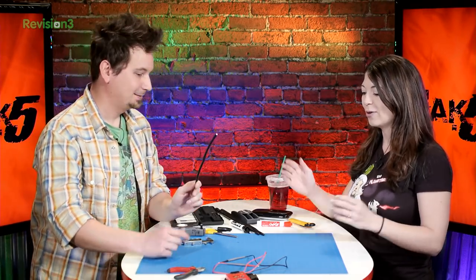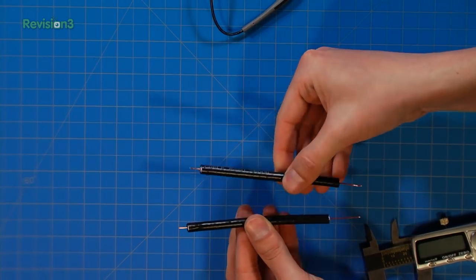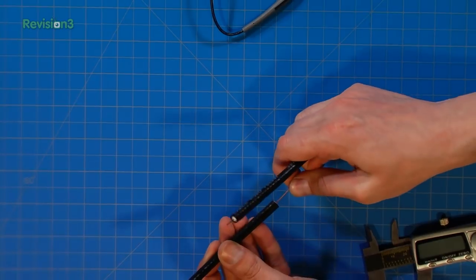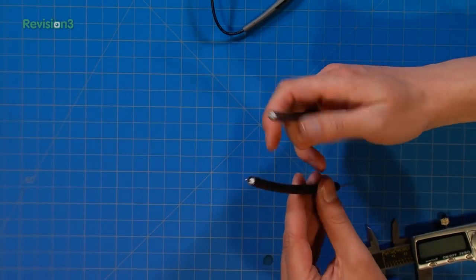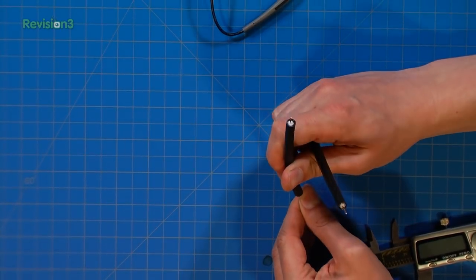Okay. Well, why don't we get straight into creating this antenna? All right. As we've talked about, we already know that our elements need to be 11.6 centimeters, or 116 millimeters. And the way that our elements are going to join, and I'm going to show you here by disassembling this guy, is electric tape. Yay, non-conductiveness. So we have these two elements right here, and wow, when I pulled that, it actually pulled the center element out. Did you see that? Let me see if I can just push that. That did not like to go.